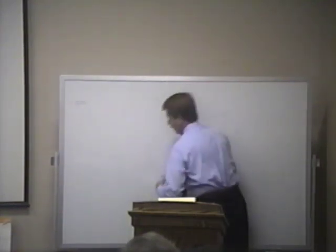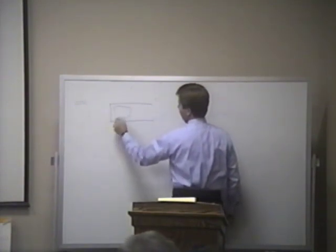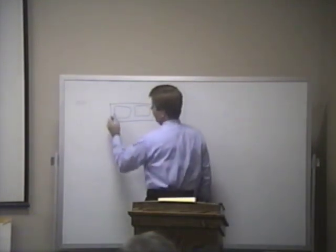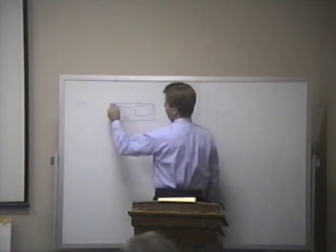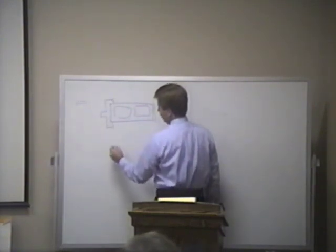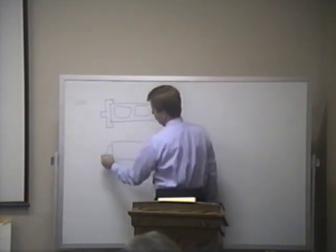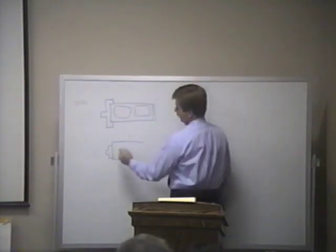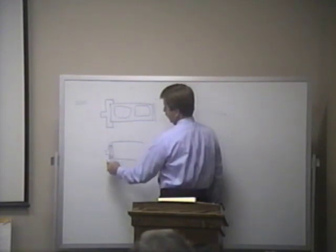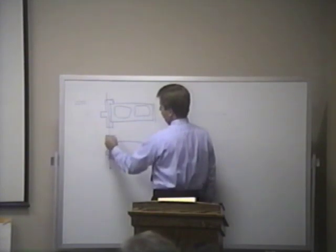That's the other point, a condition just like that which you just brought up. It's not exactly what you're saying, but with concrete block, we have the block, and here are your voids. Overlook the quality of the block there. And then you have what's called a hollow metal frame. Some of them wrap, some come clear out here and wrap. But most of them, the block's like this, and they'll set right here. Those are the ones that are vulnerable. They'll set a block in here to shoot it to, and it's totally open. It's hollow, just the gauge of the metal. You've got protection through there.